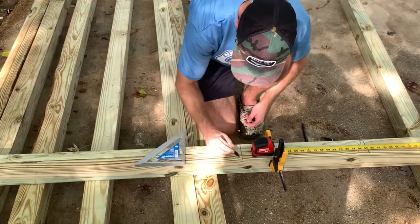That way we could use a full 8-foot sheet. So for my shed, I used a piece of trim board at the bottom, which will serve as a ledger that we can rest our siding on as we install it. For my ledger board, I used 3.5-inch PVC trim that I pre-painted black, but if you're not planning on installing trim, you can just put a few temporary nails in at the bottom and you can rest the siding